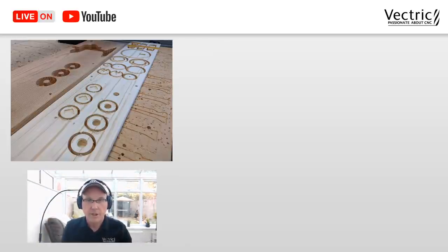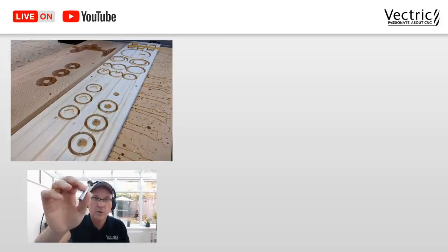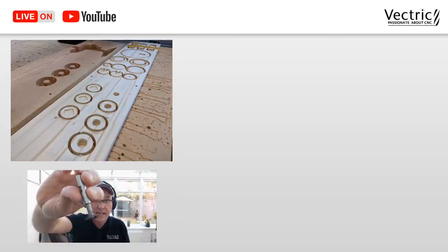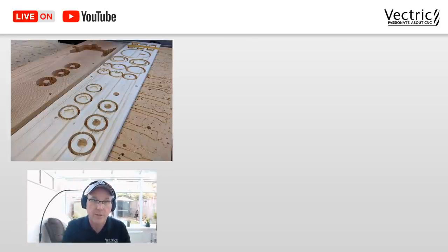Well, with my job, I wanted my post, my threaded post that holds the armature together, to be as small as possible. I didn't want this to be a big, huge thing. And so I decided that I would just make my post hole the size of the end of this thread milling tool. So 3/4 inch.